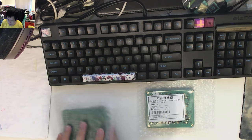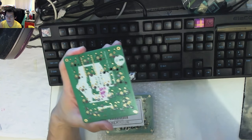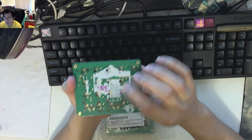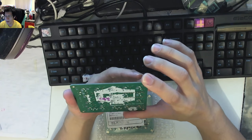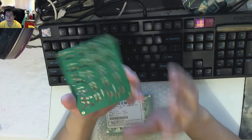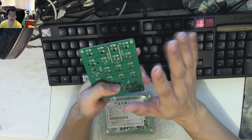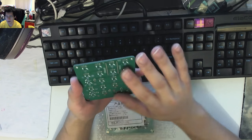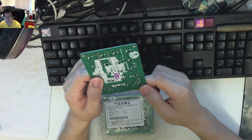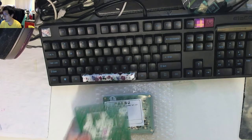They sent it to me, and that was version 2, where they actually put in a little bit extra and they got some gold plate finish on theirs. Now, the silkscreen problem was fixed up, but I discovered that on one of these, the pad itself was not completely covered with gold, and it actually had copper exposed. So that was not very good at all. And the second thing I discovered in the part 2 video, of course, was that the drill holes were loose.